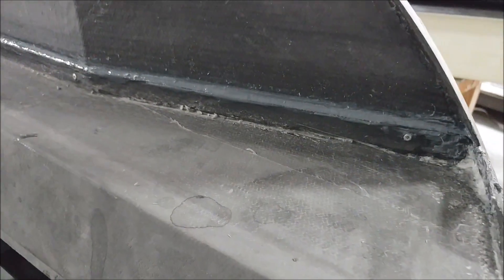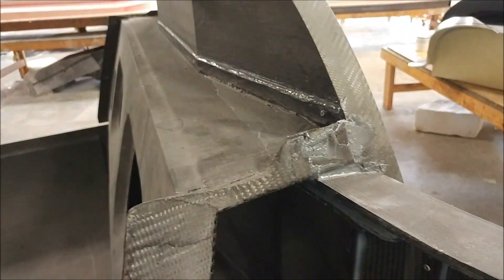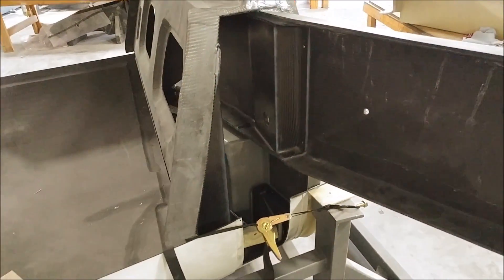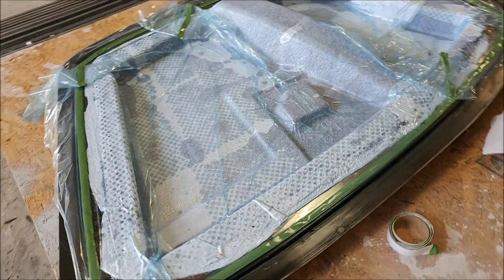The gray material is the Hysol — basically a strip along the top of the main spar and along the back behind it, with a little extra underneath. And there's that little center bracket bonded in behind it to hold it in the center. So that one's bonded into place now; the fuselage is coming along.